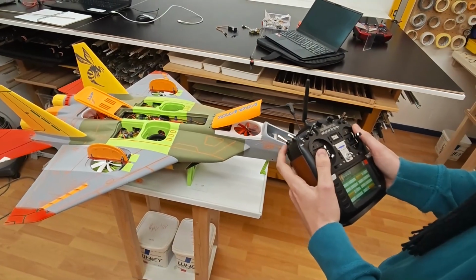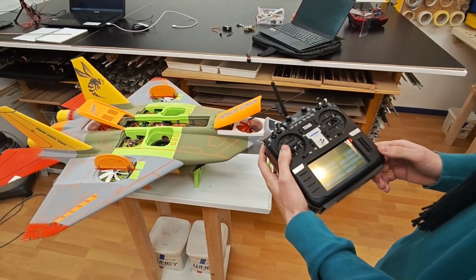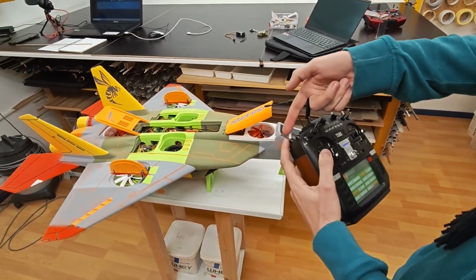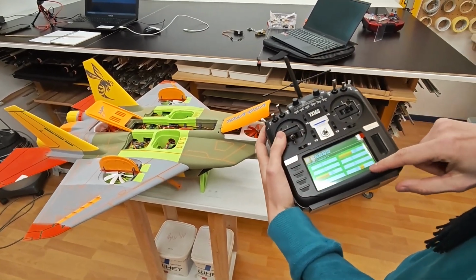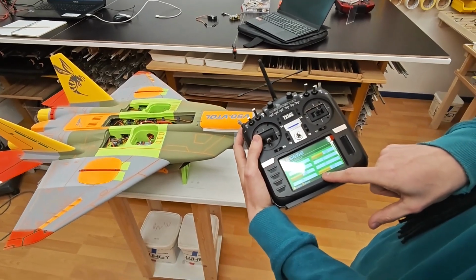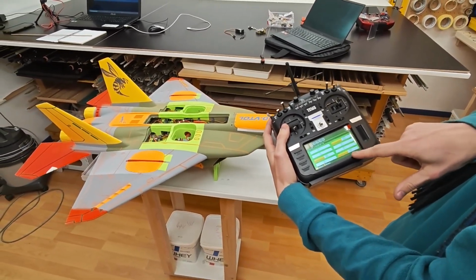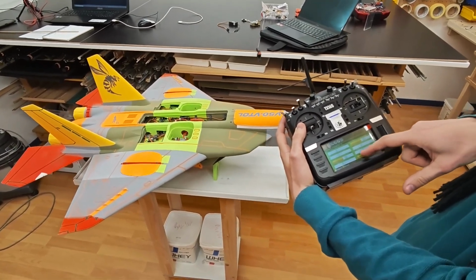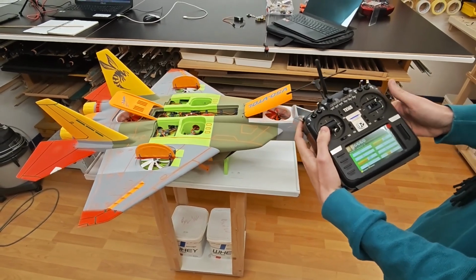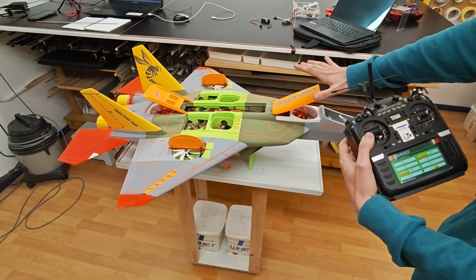So, okay, and now we want to show you what this delay looks like on the real airplane. Now we want to go from drone mode to flight mode. Okay, David? And you can see that the transmitter will slow down the transition from 100 to minus 100 in 5 seconds, which gives you important time so that the plane will be stable in the transition mode.